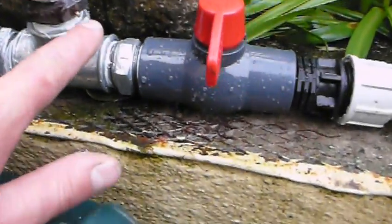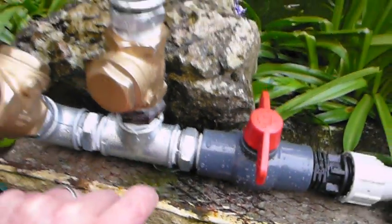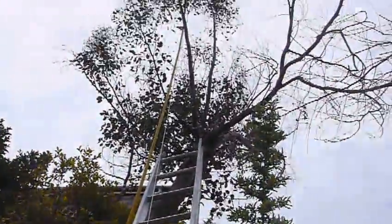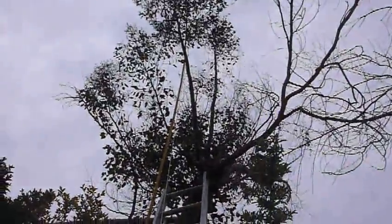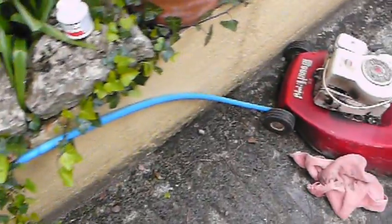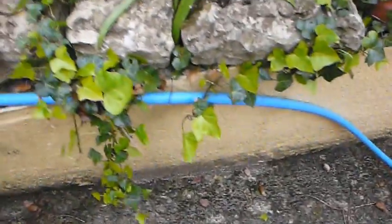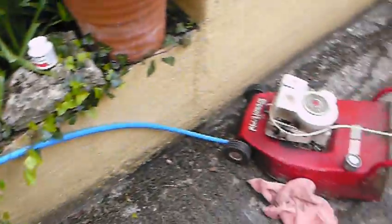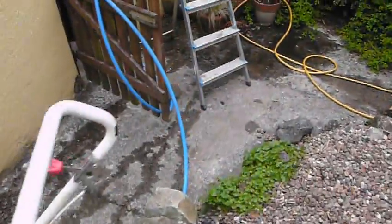There's a little snifter valve here, which you'll see running in a minute. For this demonstration I've got the half inch hose pipe going right up to the top of there — you can see it up there, right up the top of the tree. I've got it up an old eucalyptus as high as I can get it. My inlet isn't very good really — this 20mm poly pipe; ideally this should be steel as I've discussed earlier. Really this is a one inch pipe, so I should be using 25mm poly pipe, but I haven't got it at the moment.